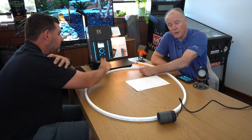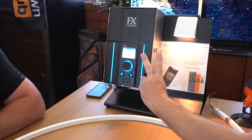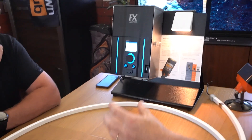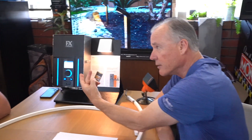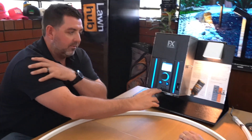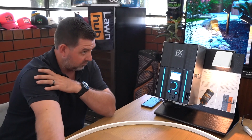Is there a polarity concern? There is not — there are two cables and no matter which one goes in, it's correct. It's not a DC system; it's AC — alternating current in, alternating current out — so it does not matter whether you go 15 or common. The lights can be told who they are or where they are in the system by plugging them in here and programming them, or doing it out in the field once they've been installed, using a separate device.